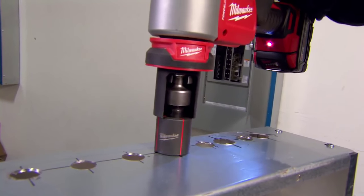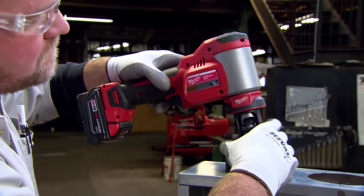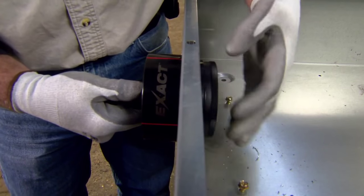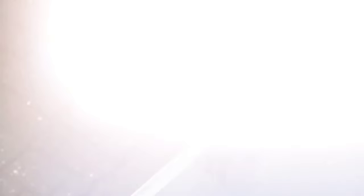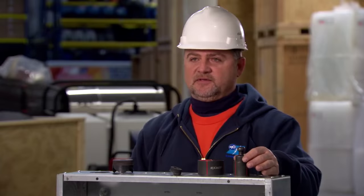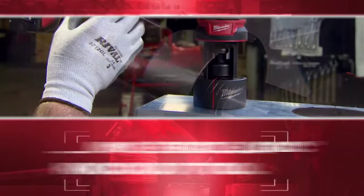Hence the name Quick — it's light, it's easy, there's nothing to it. There's three pieces. You can put it all together up in the air or on top of a panel, and then slip the actual tool on when you're ready to do the knockout. I don't have to hold 15 pounds of a hydraulic pump and try to thread the die on the inside of the can. The production's faster with the Quick Connect because you're not holding all the weight of those hydraulic heads.